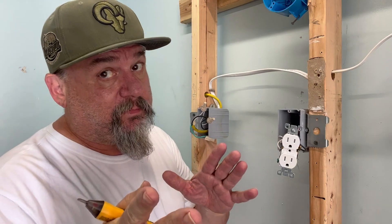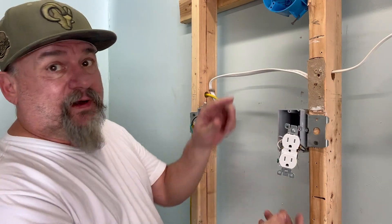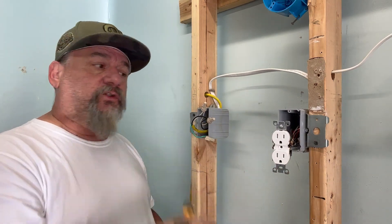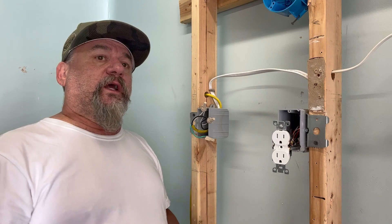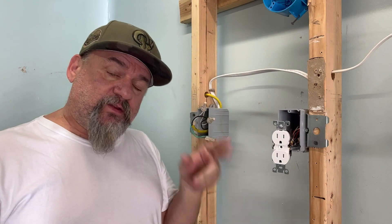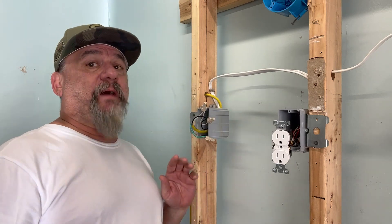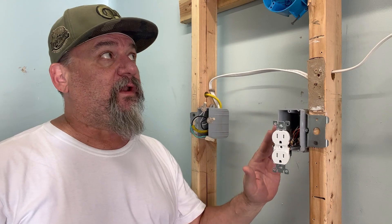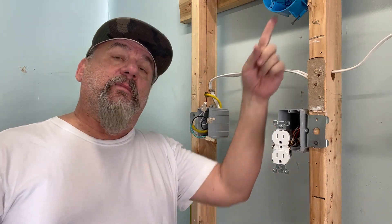First step: turn off the power and take the plug out. We've got the plug out — easy enough. But we do have four wires in here, two sets of blacks and two sets of whites — hots and neutrals. Shut the power off, then we're going to cut these wires out of this plug and test to see which one is power coming in and which one's going out. The power coming in is our line, which we'll use to power up the switch, the plug, and to send power up to our light box.